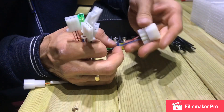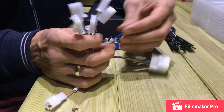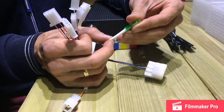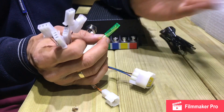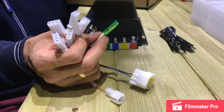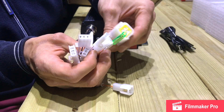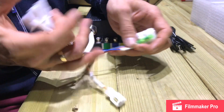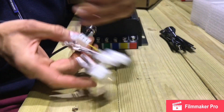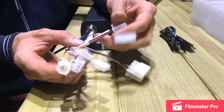The next wire we've got here is a hall meter wire. This wire is to be used with the diagnostic tool, which is designed to check your controller and your motor. You have to wire this little wire together with the hall wires to the diagnostic tool, and then it will run a diagnostic through the controller to see if there is any fault with it.